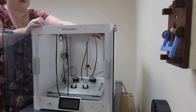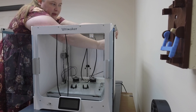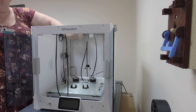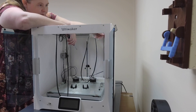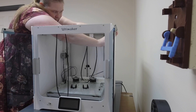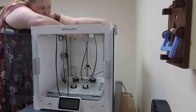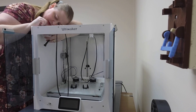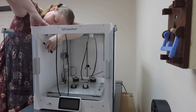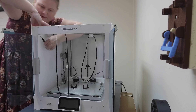Now they're aligned. Tighten the back right screw, making sure the pulley is pushed all the way up to the wall before tightening the set screw. Check for play on the axles — if it's moving, loosen the screw, push the pulley to the edge, and tighten it back down again. Do the same thing on the front left corner, making sure the pulley is all the way against the wall and the set screw is tightened all the way. This should leave the front and back perimeter rods both tight and the belts aligned.